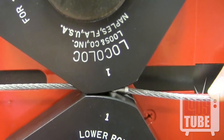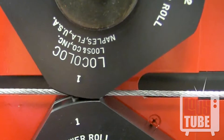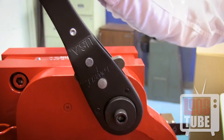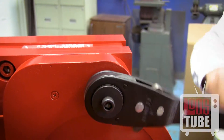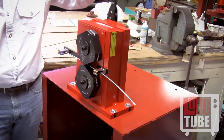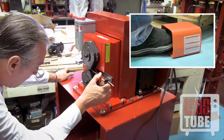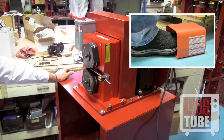You may now make your first pass. If your unit is manual, the lever is like a large conventional ratchet wrench — turn the handle to move the fitting through the dies. If you are using a powered unit, simply depress the foot pedal.